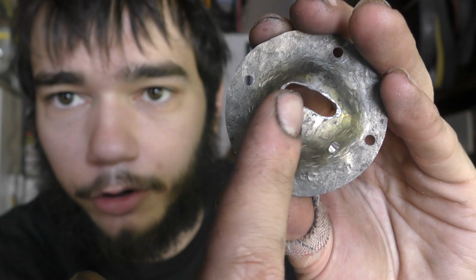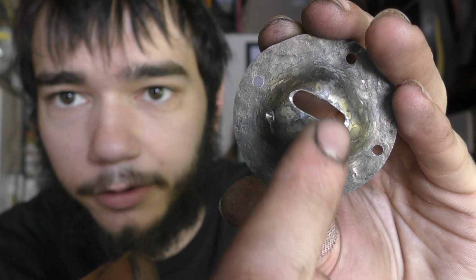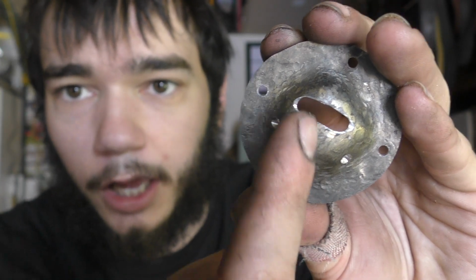Reforging this, and I'm going to forge just on this side of this mouth, of this opening. I'm basically just going to forge in there, and this is going to give me enough clearance so that I can get a larger cog in there. Basically, I'm hoping that this is going to work that way, and then after that I'll probably have to adjust the lid again and just remove the same area of material underneath here so I can get a larger cog.